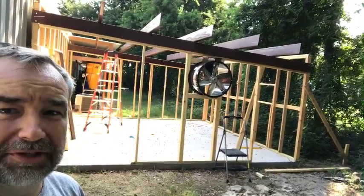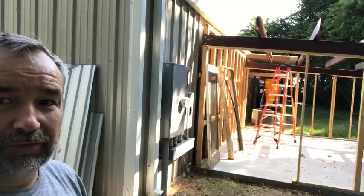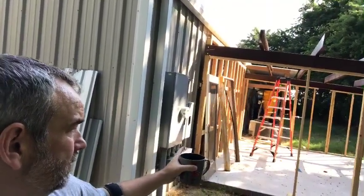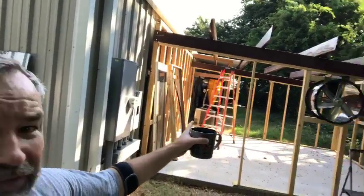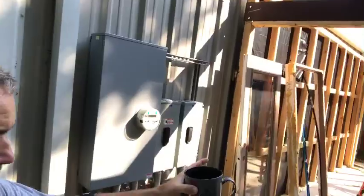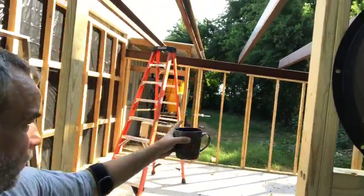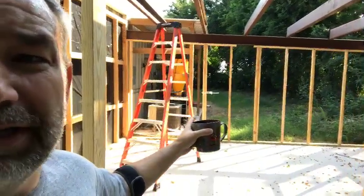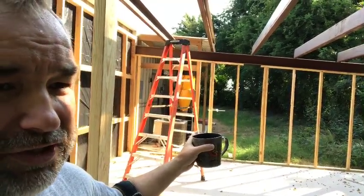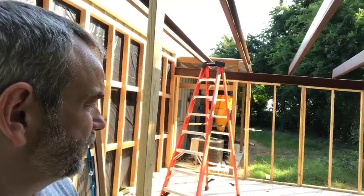You can see we got the exhaust fan mounted. The door right here against the wall is going to go in this opening right here. And then our intake filters will go on the back wall. You can see the middle section. You probably can't pick it up, but the middle section studs, there's four across the middle that are 21 inches apart, and that's the exact dimension needed to fit the filters in. And I've made some brackets to hold the filters in that screw into the studs.